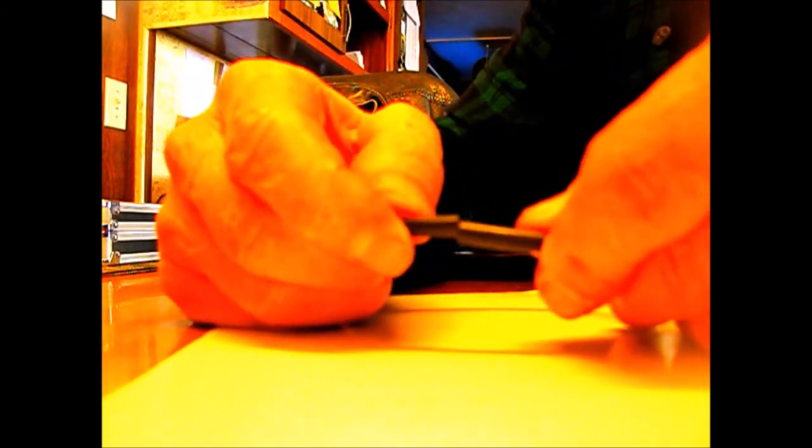Push the ends of it together, like so. Hold it there for a second. Now, the glue between the surfaces, of course, dries faster than the glue on the outside, which will give you time to wipe off the wet glue. There you go. That's how you make an O-ring. Easy to do. And now it is ready for the groove.